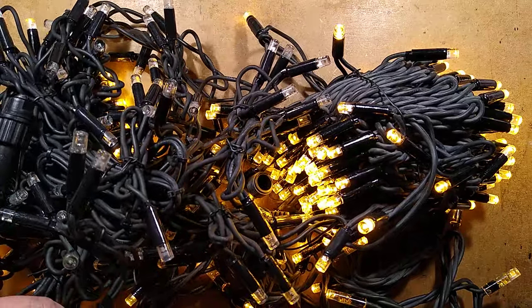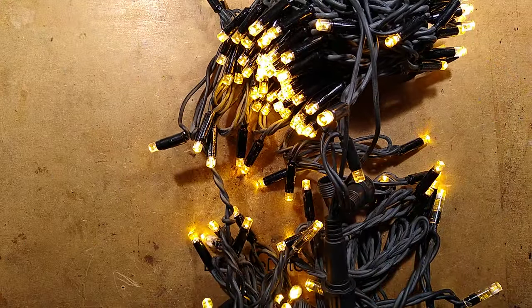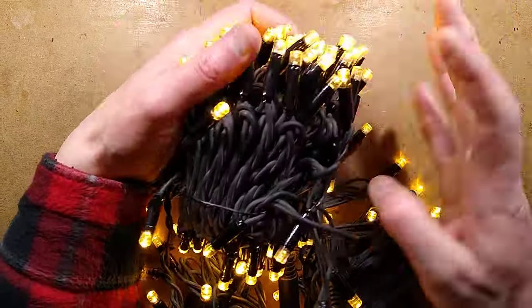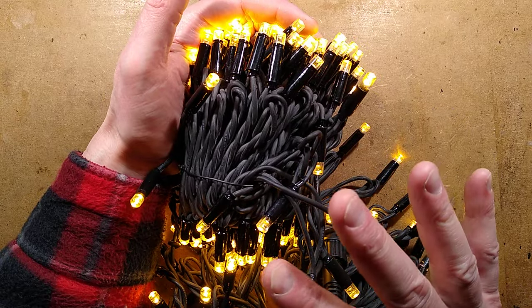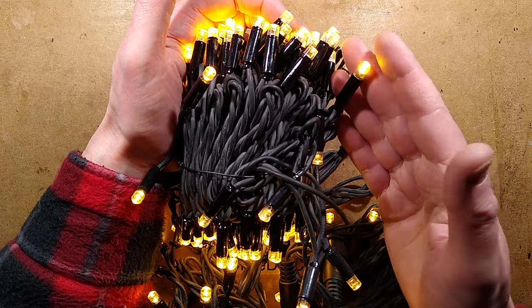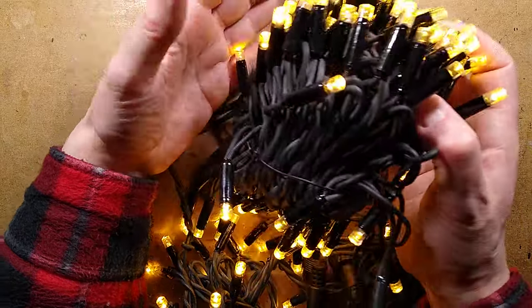So I've shown that these ones are divided: it's 100 LEDs, but because they're all typically 3-volt gallium nitride LEDs with white phosphor, 100 LEDs would add up to 300 volts. That would be very very flickery. So it's split into sections of 50 LEDs. But the coloured set is very different.